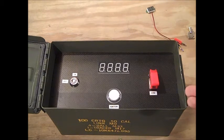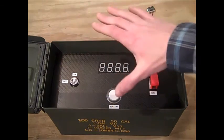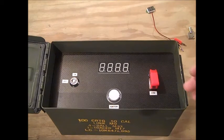On the subject of the carbon fiber, for the mounting I used some hot glue to mount the boards and the display. It wasn't my first choice, but I didn't want all the components hanging from the 22-gauge wires, nor did I want to put a bunch of screw holes in the nice carbon fiber top for standoffs. The display fits so tight I didn't actually really need glue, but I put some behind it anyway. To get that fit, I drilled a couple of holes, marked it all with pencil, Dremeled close, and test fit very, very often.